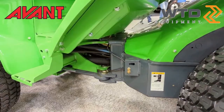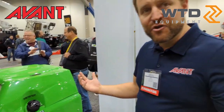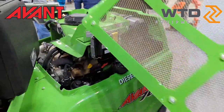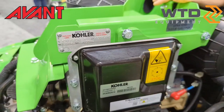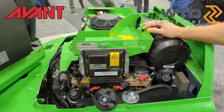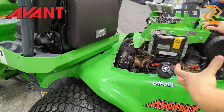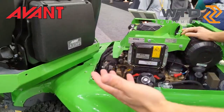We all have the engines in the rear end, and it's a hydrostatically driven machine, so all the engine is doing back there is spinning hydraulic pumps. We've got diesel engines in almost all of them — our larger ones run a Kohler KDI engine like you see here, and our smaller ones run some version of a Kubota diesel engine. In front of the engine, kind of in the center point of the machine, is where the hydraulic pumps are. They develop the pressure that runs the wheel motors and runs the boom on the front side of the machine.